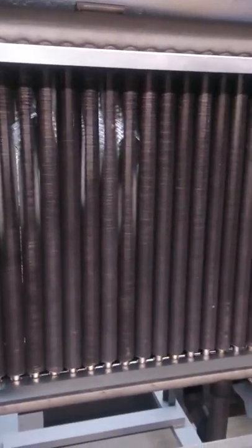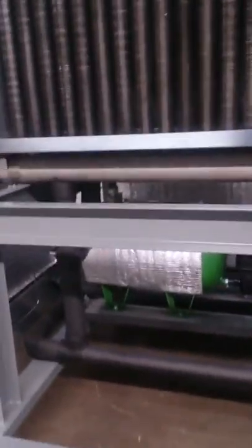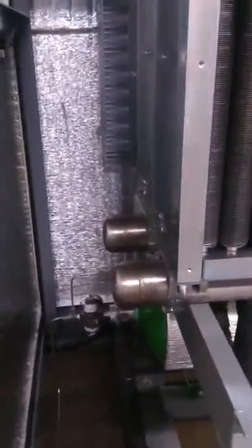It's somewhat oversized, but again, oversized makes my life better. The condensates go down these tubing down here, which we insulate, and they're also heat traced. And down here, that's the blow case, which you don't like. So what you would do is put a pump down in there to remove the condensates.